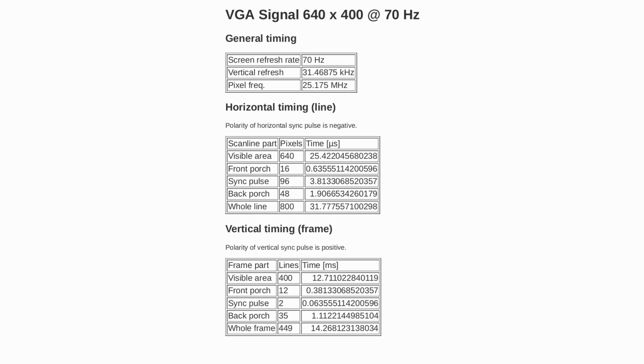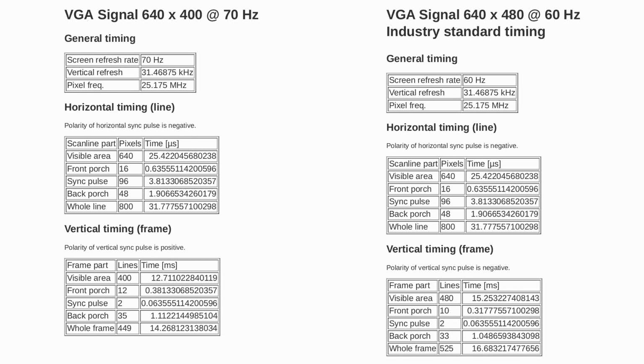Anyway, to try and make things more compatible, I added provision to output a more standard 640 by 480 at 60Hz mode. It's not ideal, because for one, some scaling is needed, and since there isn't a lot of resource to spare in the FPGA, it is rather crude, simply tripling some lines instead of doubling them to stretch things vertically to the correct ratio. And also because the Doom internal tick rate, the time passing in the game, if you will, is based on the vertical refresh rate. So at 60Hz, time-based events, speed of movement, and such are slowed down a bit.